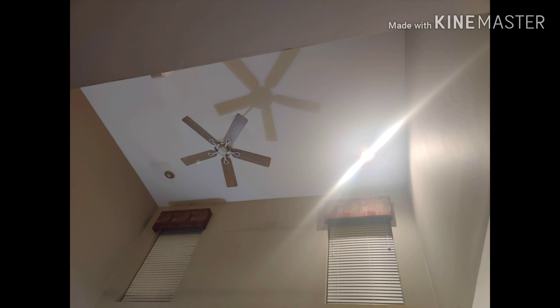It was very difficult to find an exact center, so I approximated it. I noticed the fan's location is almost centered between the two lights, so I went up to the attic and found where the fan was connected. Because it's not exactly centered, I went one bay over and identified that spot to be almost center between the two lights, and I chose that spot for drilling my middle hole on that row. The next step is using a specialized circular drill bit to make the hole to create the third light.